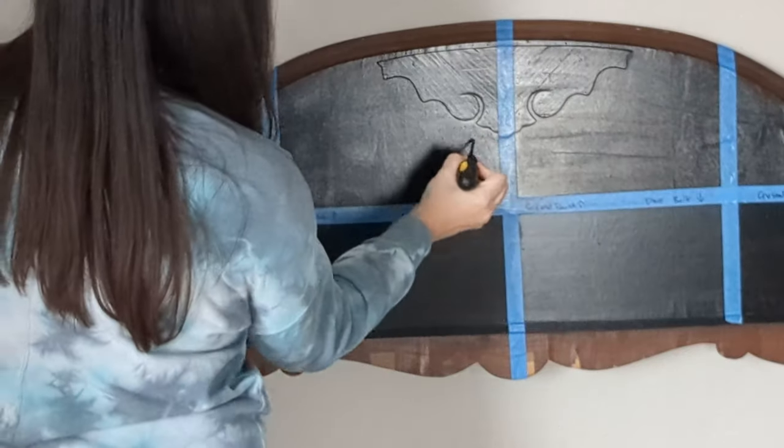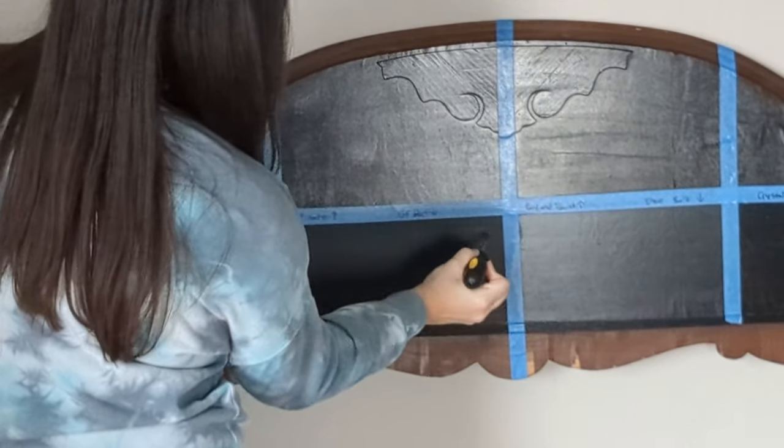At this point those are my top choices, but I want to do a couple of other quick tests to make sure they actually hold up. These will be slightly different than the tests I did on white paint, because black paint has different problems — I'm not worrying about staining, but I am worried about water rings, which can be more of an issue with darker paints. I'm also going to do a scratch test — not a fingernail test this time, we're going straight for the screwdriver.